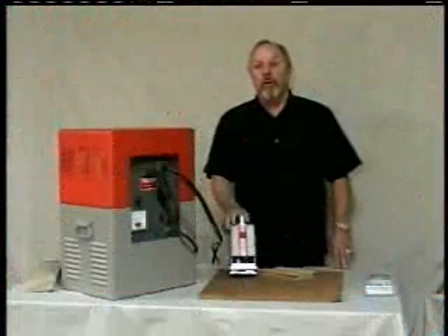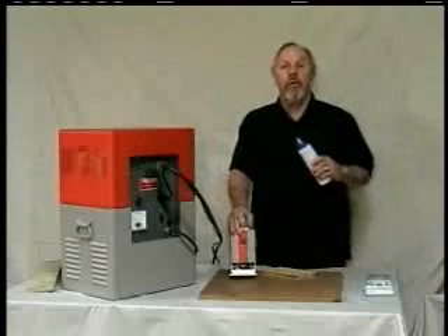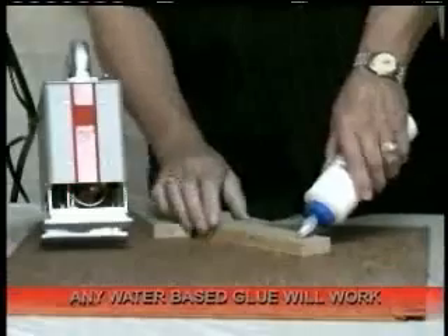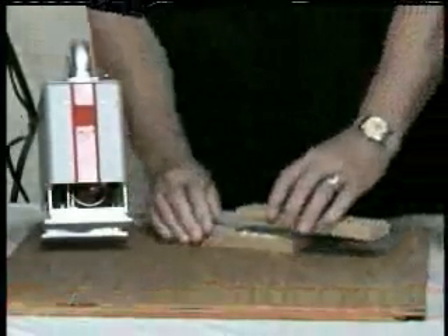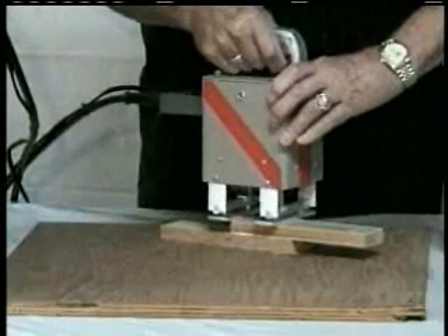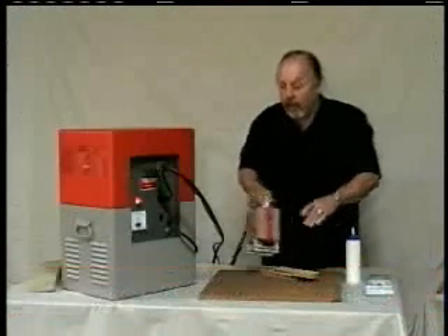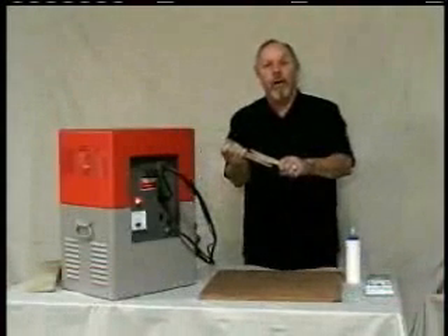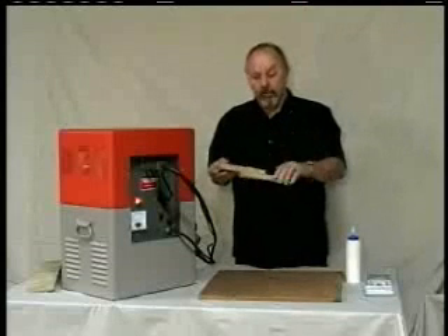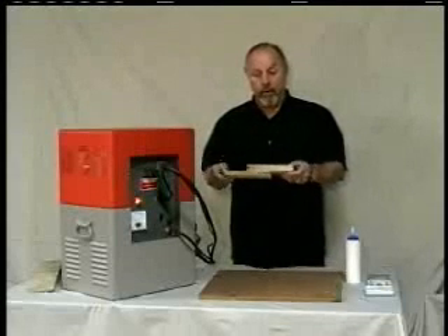Let's demonstrate how the machine operates and how quickly it will dry the glue. We're using Tight Bond II glue, which is a pre-catalyzed glue, and because we are heating the glue it will kick off the catalyst and work very well. Watch the board and the glue line as I put the two boards together — notice the steam coming out of the joint. Five seconds or less is what's recommended. That quickly we have caused a set in the glue, released the moisture, and the two boards are locked together. You can wipe the squeeze. The glue is not cured — it is set. No matter how long we leave the machine on there, it will not cure the glue. That is a 24-hour chemical process of the glue itself.